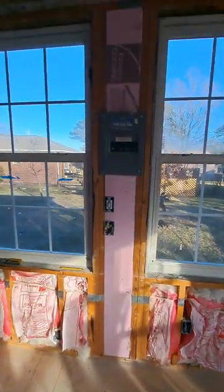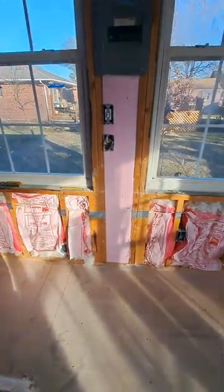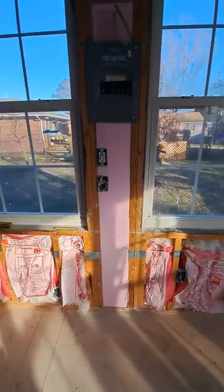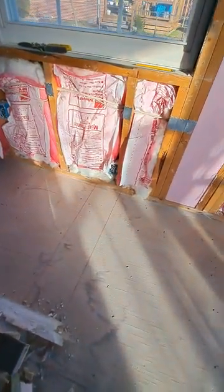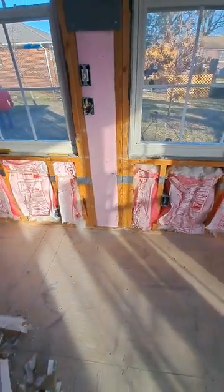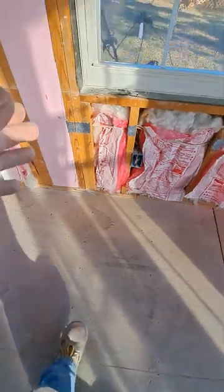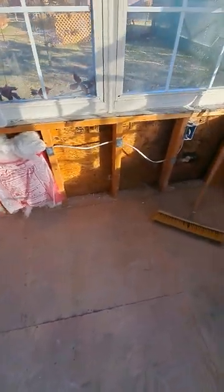In front of this system here, I'm going to put an 80-inch cabinet. I don't want to move that power box — there's just too much involved in moving it. I've got to move the outlets, the switches and stuff. That lower outlet ran power for the baseboard heater that was there, but that's all got to be relocated. So we've got an 80-inch cabinet there, and then the vanity will start right about here. It's going to be a 72-inch vanity, coming over to about here.